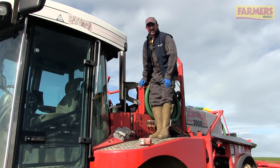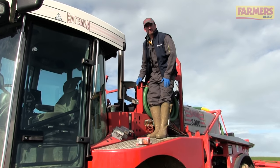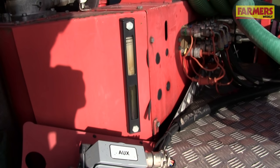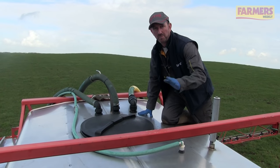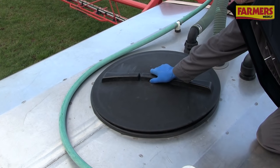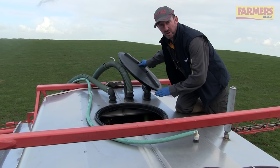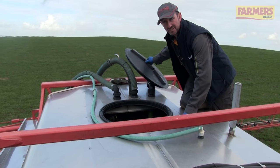The first thing to look at would be your pre-start checks before starting the engine. So fuel, then on this particular sprayer we've got a sight gauge here for the hydraulic oil, one the other side for the hydrostatic oil, engine oil on the dipstick, coolant levels. While I'm up on the back of the engine bay I also have a quick look in the top of the tank just to make sure that everything is nice and clean and that the tank rinse nozzles have worked properly to do their job.